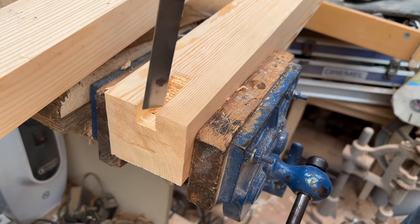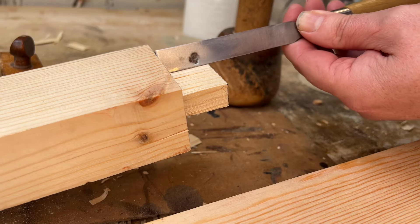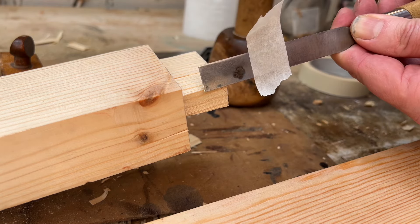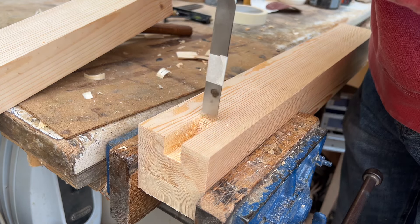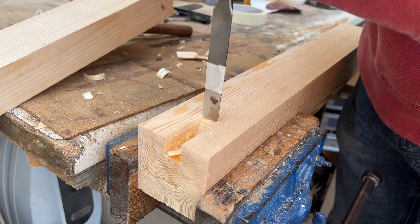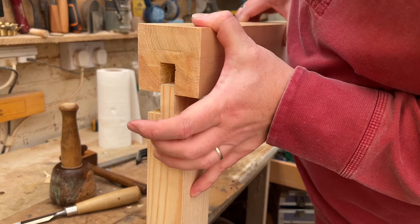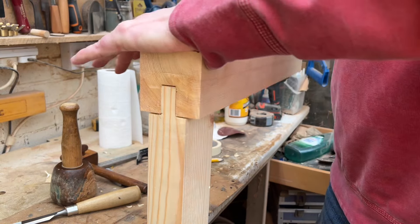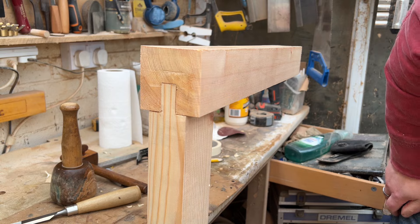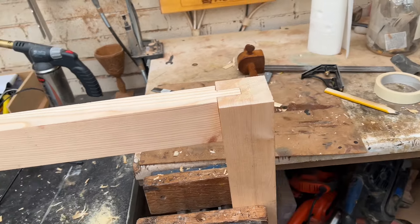When you get to the end you can just tap that out and it'll stay the same width you've been digging all the way through. We also need to know how deep it needs to go, and a neat trick for that is to hold the chisel up against the tenon you've made and put a little bit of masking tape on — there's your depth gauge. Head back towards the pencil line, empty out those sections, get closer to depth, then slot one into the other with a little wiggle, and there's a nice joint. Just glue that in place and there is your forever table frame.